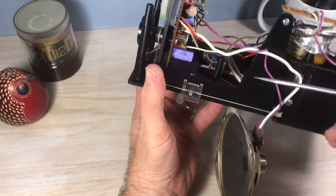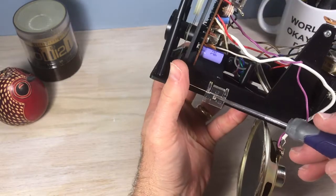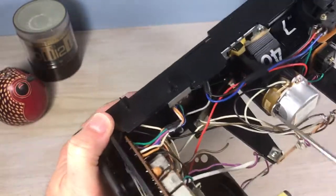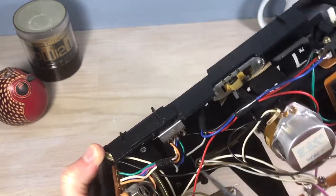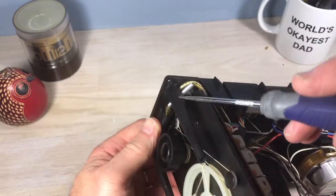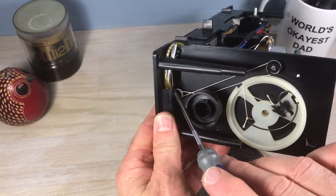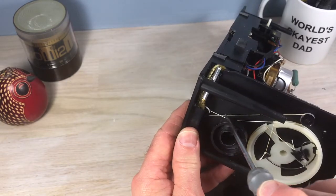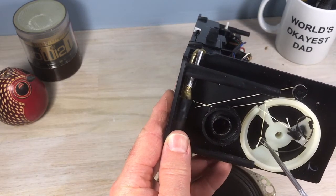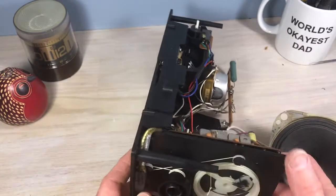It goes right to this wheel here and that's when it attaches. I'm going to go ahead and disconnect it — it'll be much easier if you just get that out of your way. The string kind of triangulates back up in here, then right over top of this screw area — there's a smooth area, you can't even see it — and then there is a wheel way back in there. The string drops down and reintroduces itself to that wheel again. The string is on the front side closest to us, comes around and then back down to the tensioner. It's like a maze.